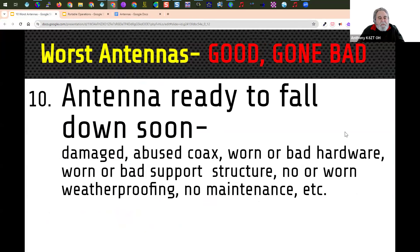Number ten: the antenna was put up properly, you used correct feed line, everything worked great for years, but you've never looked at it again. Support structure may be damaged or failing, coax may be full of water, elements may be broken off, or the feed point coax may no longer be attached to your antenna. I had someone nearby who couldn't get their radio to work. We barely made contact. The next day he told me the coax was lying on the ground while the dipole was still hanging in the air. An antenna that's ready to fall down needs to be fixed.